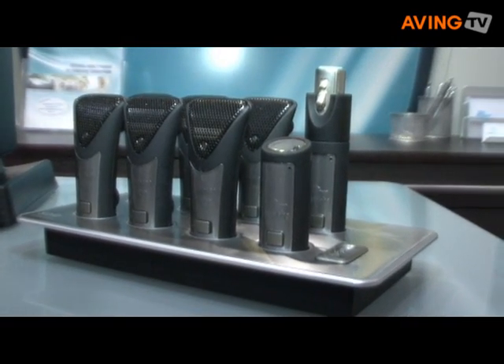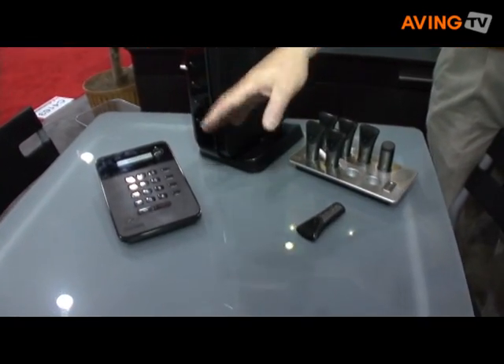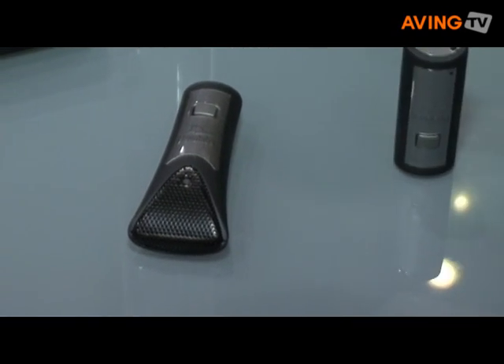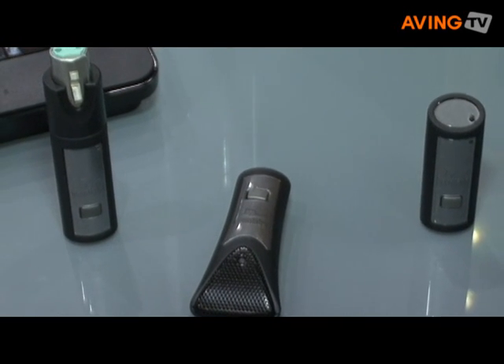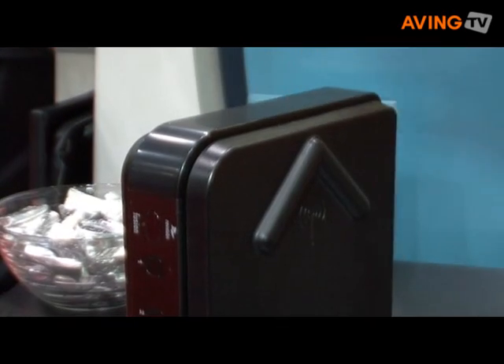It's targeting rooms where there's not such a high level of equipment or install involved — it's just plug-and-play. It works great with video conferencing, has its own telephone hybrid for audio conferencing, and you can operate the dialing with an IR remote that comes with the product or use our tabletop dialer, which is an RF remote with a display — both wireless to the base station. The microphones come in three types: a wearable that clips on, a tabletop boundary microphone, and an XLR adapter which turns any handheld microphone into a wireless microphone. We have four and eight channel versions of the Fusion base.